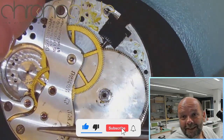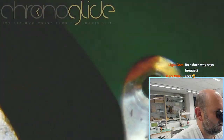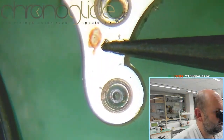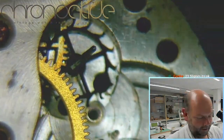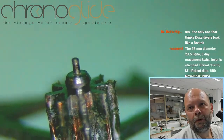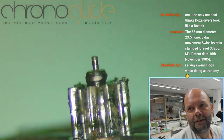I'll simply remove these and then take out the barrel. There's no hair — let's see if I can remove that stain during the restoration. Now I can take out the escape wheel. You can see the dirt really went through the complete movement — it is dirty, wow.